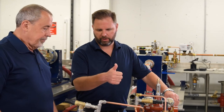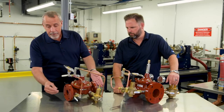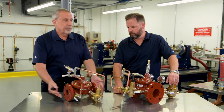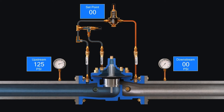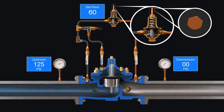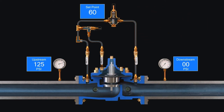So it's really acting like a governor for the whole valve — you either throttle up or throttle down. So if you're going to set this up, your plumbing would be two-inch, two-inch or four-inch, four-inch, so it's pretty easy on the plumbing side. You have water flowing, full pressure coming in, and you basically take the set screw off, set it to 60 psi, put this thing back on, tighten it up, and it's going to deliver 60 psi downstream all day long, constantly.